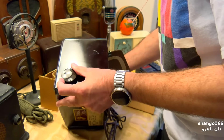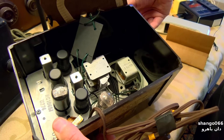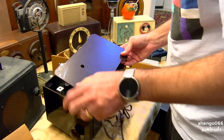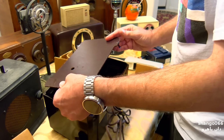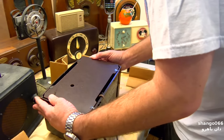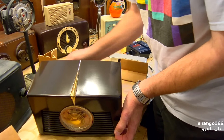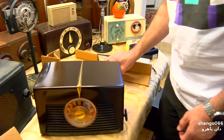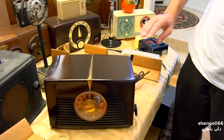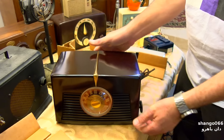Let's look at the back. It's just a five-tube radio. There are two schools of thought on this: there's brute force — just plug it in and hope it explodes on video — or the other approach, which is that the filter capacitor most likely needs to be reformed. You do that slowly. It could blow up; if it's shorted it might sacrifice the rectifier tube. So maybe we should not plug it in. Too nice to gamble on something happening.